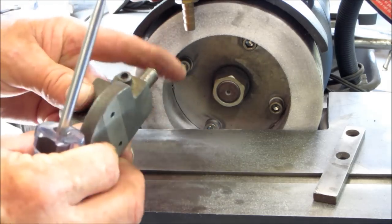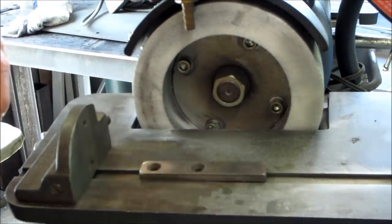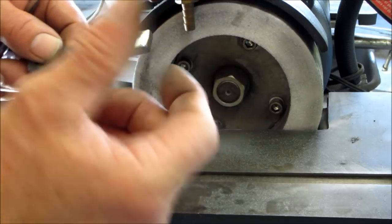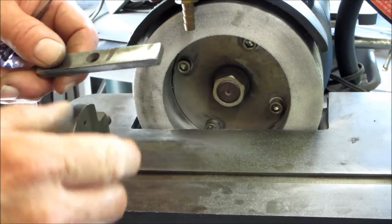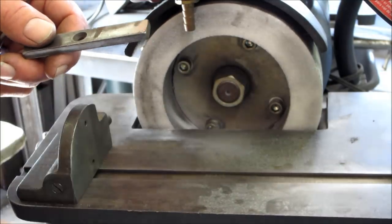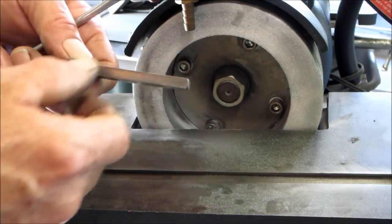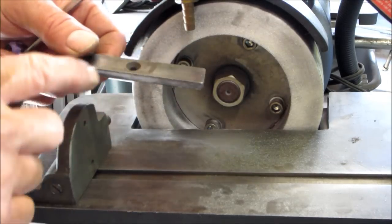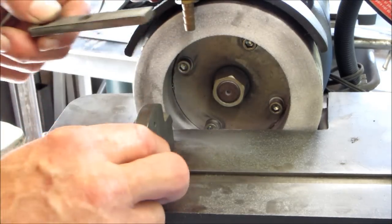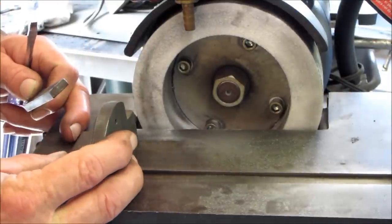All right, so what we're gonna do is machine the guide to match this slot, because this slot also matches the other Chinese grinder we have. And of course, this is metric here. This is like 465. We got to turn this thing down, and it's an eighth of an inch of depth there, so we'll take an eighth of an inch off of there. The screw pattern will still fit into this, and then we can use this like it originally was used.